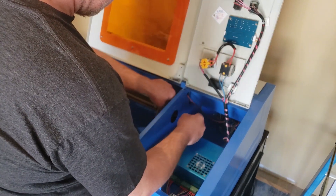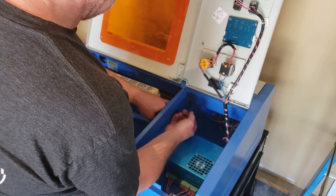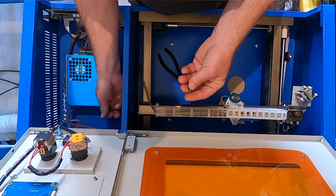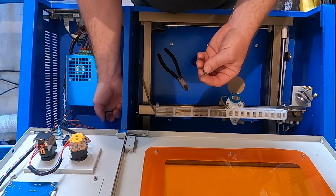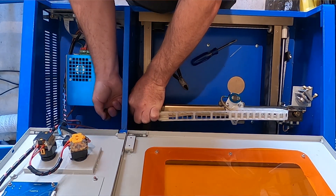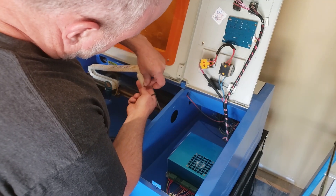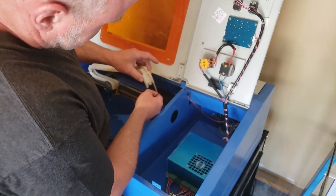The upper screws here mount the little sliding mechanism to the gantry rail, so I'm just going to remove those. My system does use these socket head cap screws — I think they're M4s. So if yours are different, you'll need to get some M4 socket head caps like this. Because when I show you how they go into this mount, they just drop into these holes right here, and you want to make sure you're using the right type of screw and the head seats all the way down into that hole.